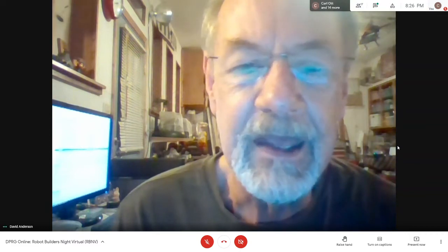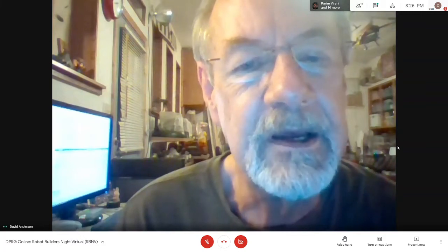Yeah. Well, I have a halfway solution to that I've used before. I don't know if any of y'all looked at the code that Chris gave us a couple of months ago, but he has to do the same thing I had been doing, which is that while you do the math, you're constantly calling this function that is going to clip you to plus or minus 180. You have to do that every time you do an addition or a subtraction or whatever. That's basically what I was doing also. But I found an easier solution: I actually keep two global thetas. I keep them in radians. One of them is the one that scales plus and minus 180. But the other one just accumulates endlessly. That is, I don't clip it. So if you want to rotate 90 degrees, you just grab that number and add 90 to it, and it tells you which direction you need to point. So you don't have to do all of that correction.